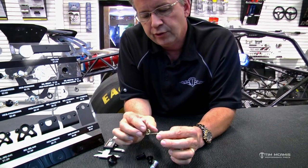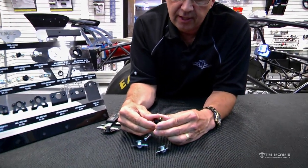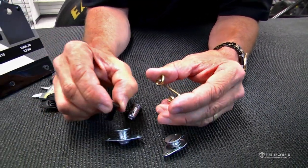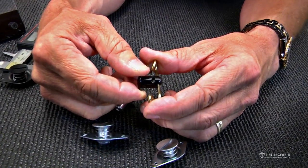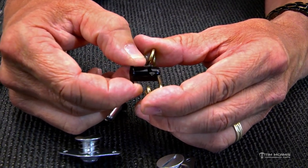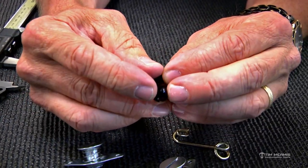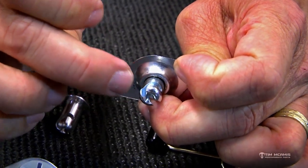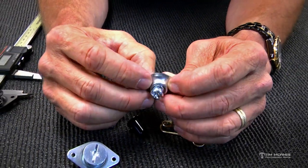You don't want too much compression where you're really having to force it. What happens if you get a mismatched set — say too short of a stud — and you're trying to fasten it, maybe with a screwdriver that's not suited for the job: this is an aluminum stud, and what's going to happen is it's going to be tight. These things should click into place, nice and smooth. If the spring is too deep and you're going through too thick a panel, you end up blowing this thing out. This is machined aluminum and it will spread apart — even steel ones will do the same thing. When you're putting the heat on and they're not adjusted properly, you'll end up spreading it out, and then it won't want to pop loose from the tab.